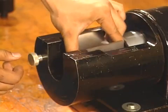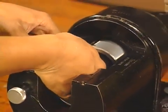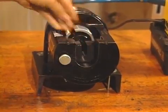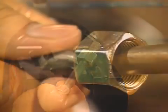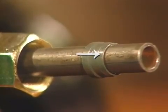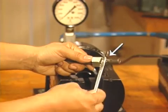First, install the large piston stop adapter into the body of the Hydra Tool. Then, install the small RAM insert into the center piston assembly. Turn until the roll pin locks the small RAM insert into place. Next, install the nut support into the backup plate opening and assemble it from the inside so the shoulder seats squarely in the counterbore of the backup plate. Now, install the fitting nut and ferrule onto the tube. For EO fittings, point the straight pilot section, or bite edge, of the ferrule toward the end of the tube you're presetting. The raised portion points toward the fitting nut. Also lubricate the bite edge of the ferrule to reduce friction and die wear.